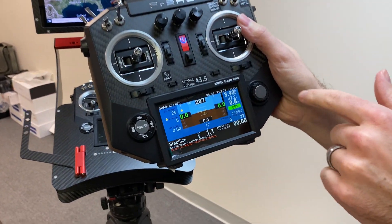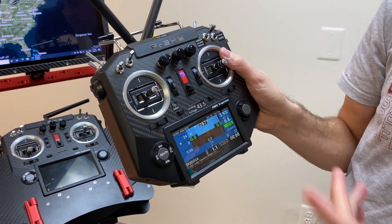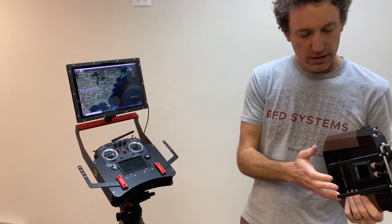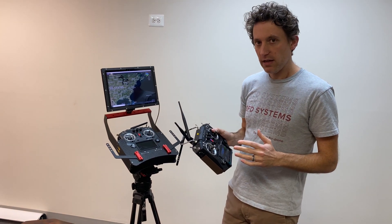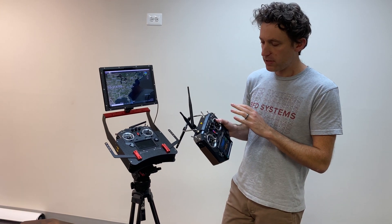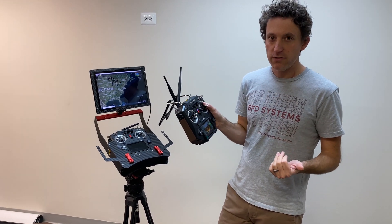You have your two tapes here for vertical speed and horizontal speed, voltage, and cell voltage — though the cell voltage is really an estimate. That's how you'd use this RFD in a Horus controller like this. The FreeFly comes with a Futaba which is a great radio, but the RFD will offer you significantly longer range and way more telemetry. The Futaba generally just offers you the voltage.